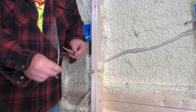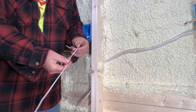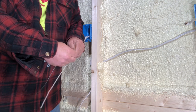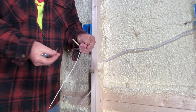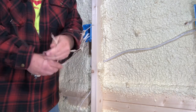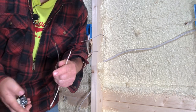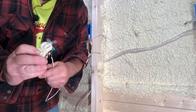I already pre-cut another wire — this is probably way too long, but I pre-cut it. You wind all the whites together and then take the three blacks and wind the three blacks all together. Then at the end, when you have these two wires that are left, you would wire those to the outlet.